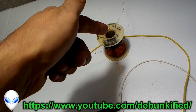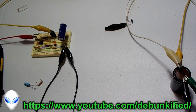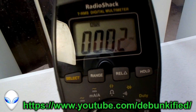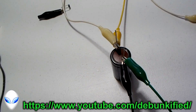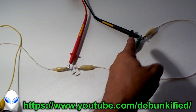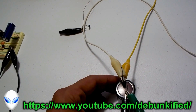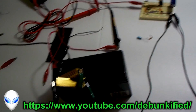Right now we're showing this to eliminate any possibility of MOSFET leakage. There could be MOSFET leakage in here, so to show that — everything's off — that's the voltage reading across the capacitor. Not only that, but there is a resistor right here across the capacitor, so we have a load here as well. This is to show that the capacitor should be draining itself through the coil — we'll hook that up in a second.